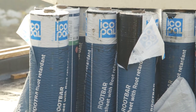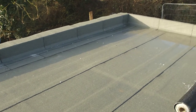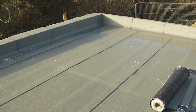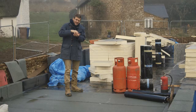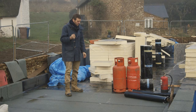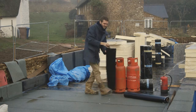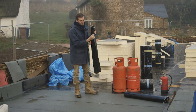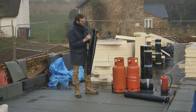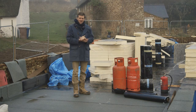The reason it's got this green colour is that it's got copper in it, and that's to stop the roots of the grass roof growing through the membrane — which you can imagine would be rather catastrophic on any flat roof. So this is a really high-quality, thick, rugged, root-resistant layer of asphalt which goes on top as the top layer of waterproofing.